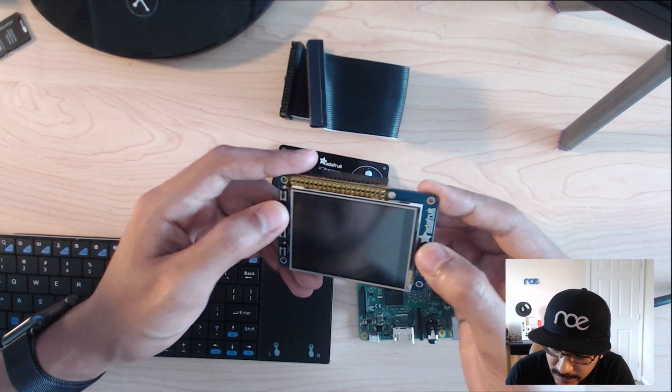We'll need to burn this to our SD card, so I'll grab my SD card and plug it in to my computer. I'm going to use SD Formatter to format the card — it'll just make it nice and clean. Then for burning, I like to use Apple Pi Baker — it's nice and easy. Select which card you have — disk 5, 4 gigs, generic storage device. Under image file, click the three dot button and drop the image into the folder, hit open. Now I'll hit restore backup and it'll start baking the pie.